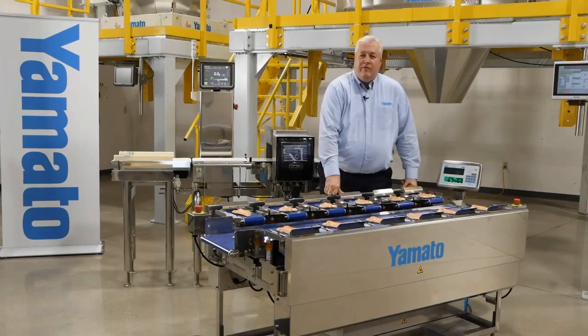The TSUW is available in a variety of configurations to best meet your application needs. We offer a TSUW Large — the machine I'm standing in front of here — designed with wider and longer weighing conveyor heads for running larger items such as frozen fish fillets. The specially designed wide weighing conveyor guides allow you to run wider products as well. Our TSUW 205W has 12 weighing heads capable of running at speeds up to 30 weighments per minute, and the TSUW 206W has 14 weighing heads capable of up to 40 weighments per minute.